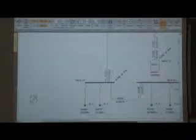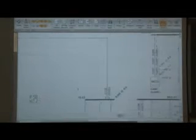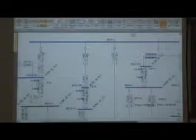I'm going to close this breaker. It simply says it's a low voltage air circuit breaker. Okay. We close it. Well, that's interesting. We get a little bit of watts going to the left and a little bit of vars going to the right. It doesn't amount to much. So that looks like it'll probably work. Let's go up here and open the breaker. Where was that breaker? It's this one over here, wasn't it? I'll open this breaker.